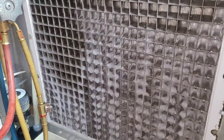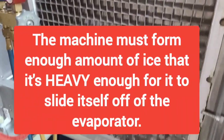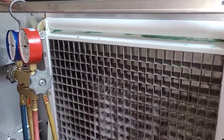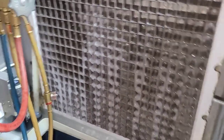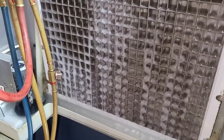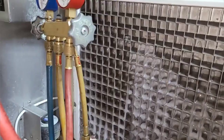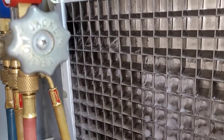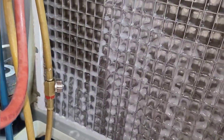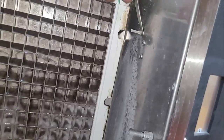In this case, the sheet of ice is not heavy enough to make itself slide off — it cannot slide its own load off. So sometimes the cubes end up melting completely and coming apart inside the cubicles, and then it's just a failed harvest. Like that — see? Failed harvest. The only reason it's staying in harvest this long is because it hasn't activated the switch yet. We can pull it, and that makes the machine think it dropped a load of ice, so it goes back into freeze mode.